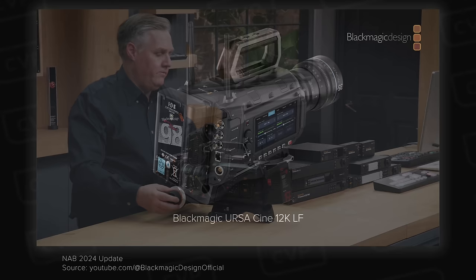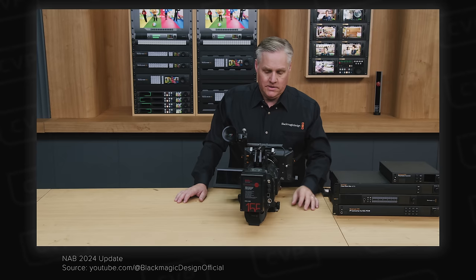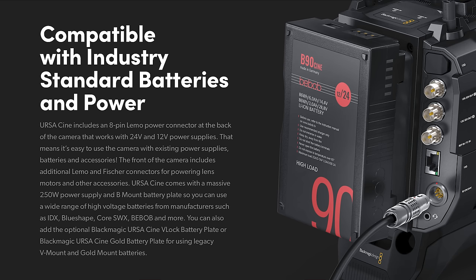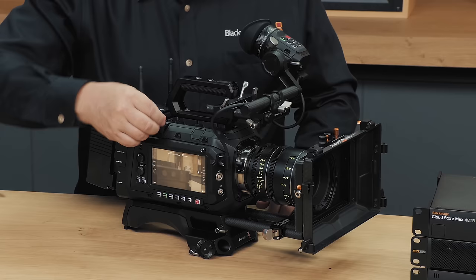On the front you have a 3-pin Fisher and 7-pin Lemo, both of which are 24 volt and share two amps between them. The antennas on top are used for the camera's built-in Wi-Fi so you can offload H.264 proxies wirelessly. Because of all this new tech it's a 24V camera system, so Blackmagic made it a B-mount camera as standard, though they plan to explore V and gold mounts in the future. Power draw is roughly 80 to 150 watts depending on mode and accessories. There are also several USB-C ports across the camera for future accessories, the EVF, tethering to a phone, or external recording.